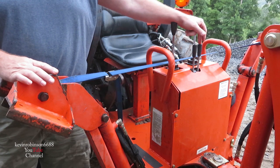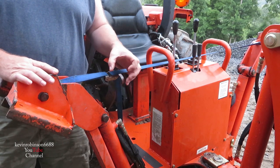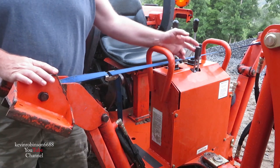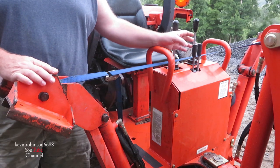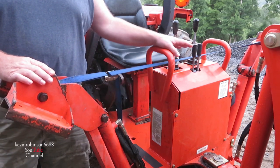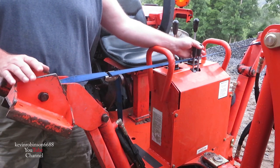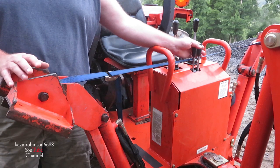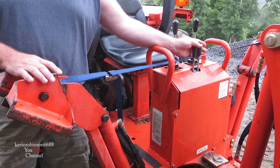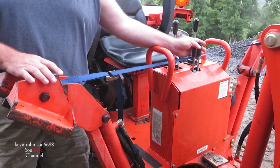We really didn't know whether the problem was the valve or the cylinder. The cylinder can bypass internally, and it could also leak through the valve. I've kind of come to a conclusion that it's going to be our outriggers — and the reason being is that there's still pressure on these while we're working. While I'm digging, the outrigger will leak off. I thought with pressure on it, it would either push it down or pull it up, but it's not — it just seems like it's leaking off.